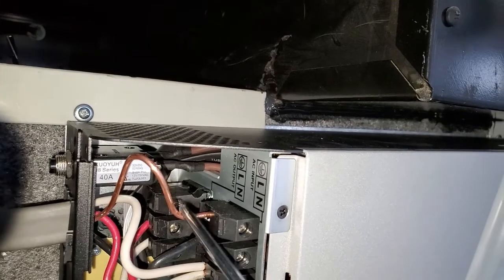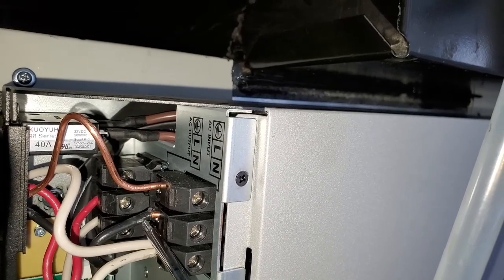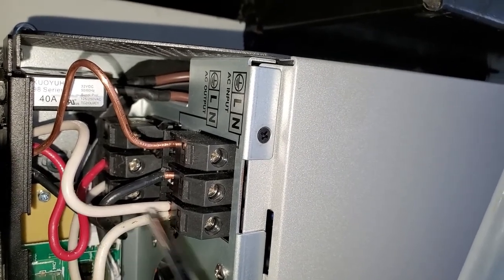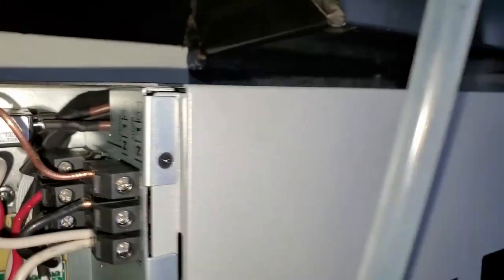So you only need one ground wire. So AC input, remember we had that as my black wire coming in from our 15 amp breaker, coming into AC input. Neutrals are common, neutral output and neutral input are common, and then my red wire is my AC output. So now the moment of truth is, let's turn this inverter on,